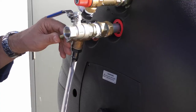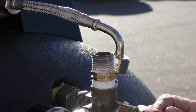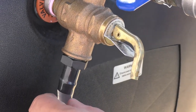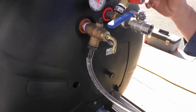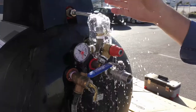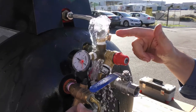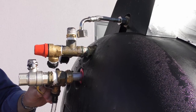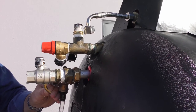I'm going to open up the PTR valve discharge. We've got water coming out of our PTR valve down into our collector — it's going to fill up our collector gradually, pushing all the air out and filling the mantle around our jacket. If you put your finger over that outlet, you'll feel air coming out initially, then water. It's important that you absolutely ensure that all air is discharged. Once it's running freely, I'll close that off. There's water running out of there — we've filled up the collector and the heat exchanger around the tank.